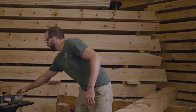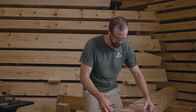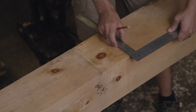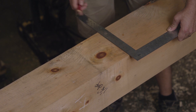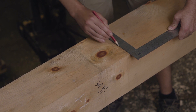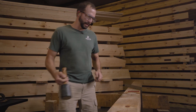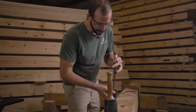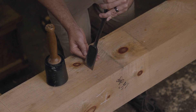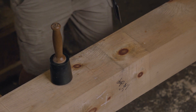Like I mentioned before, I want to preserve the slant cut that exists at the bottom of this mortise, which goes up an inch and a half on the other side. So I'm going to use this inch-and-a-half thick leg of the framing square and just make a little mark with the pencil — just something to avoid with the mortiser. And again, I'm going to cut the end fibers just to maintain control and make sure we don't get any blowout.